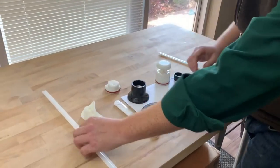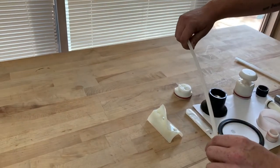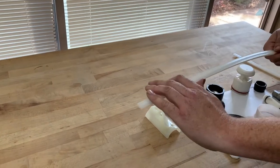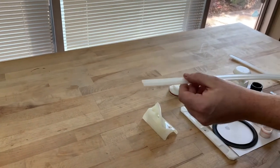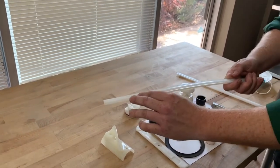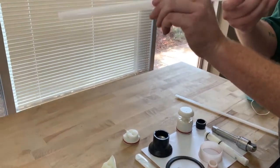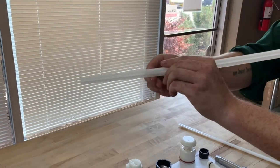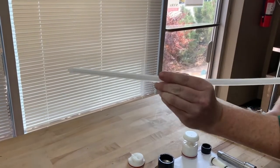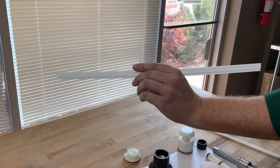So here's an example of a Taylor blade and a Stoelting blade. This Taylor blade will get wrapped around your auger. If you have trouble, try running this under warm water. What I wanted to bring to your notice is that on your Taylor blade, if there's a bunch of nicks and scratches, then as it's scraping the barrel, it's missing that, and that can cause the auger to get a little out of alignment, and then that can move back to the gearbox and the receiving bolt.